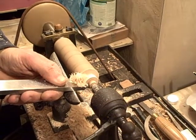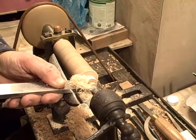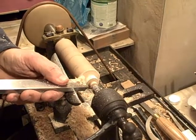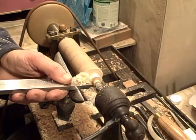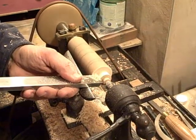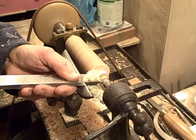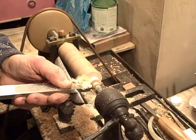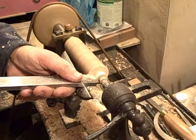I want to know if the lid fits to this. That hole is 11mm or 12mm; this is going to go to 16mm, which is 4mm more — only 2mm a side — and that bung there is probably about 2mm bigger than the hole that it's in, depending on whether it's an 11mm or a 12mm hole. The other advantage of doing it with the scraper, of course, is it doesn't cut to the side, whereas the parting tool would sometimes be eating in a little bit into that left-hand side. I don't want to do that because I don't want to take that down anymore.